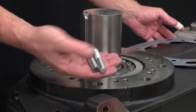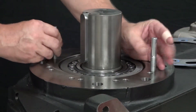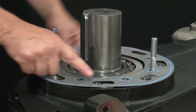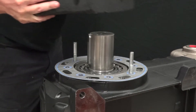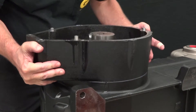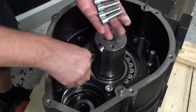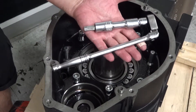Insert two 12mm positioning pins into the proper mounting holes. Apply a new gasket and put the inner gear reduction housing back into place. Thread six of the bolts into the inner gear reduction housing and use a ratchet with a 10mm hex to tighten.